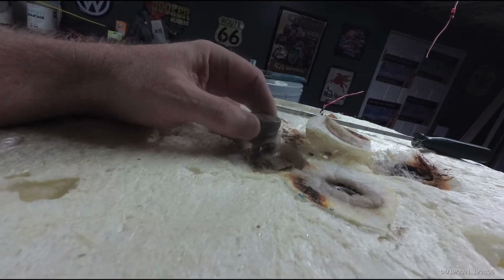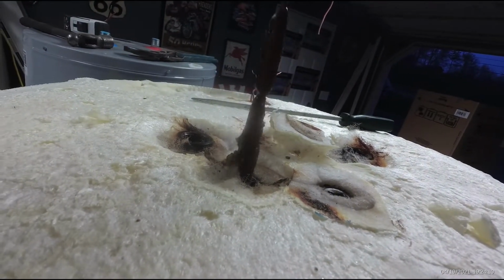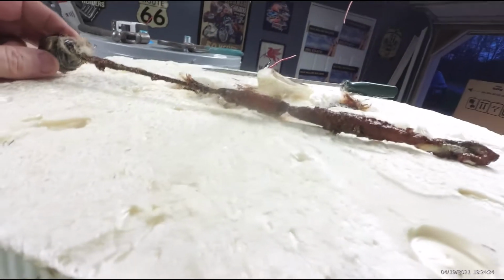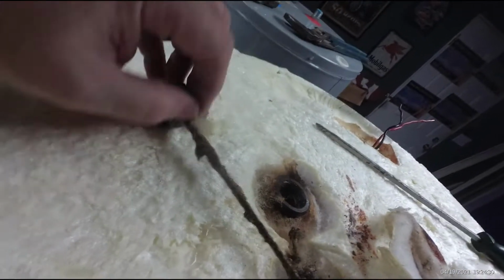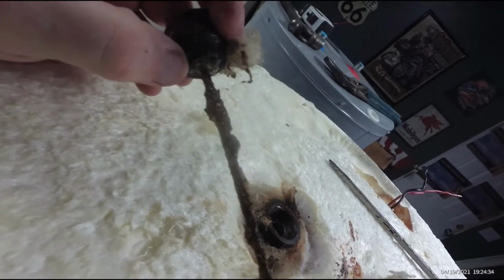Here is an 8-year-old anode rod. Now, this is only about a foot long, and it's only about the size of a pencil lead. There's a little bit of corrosion on it. This thing should go all the way to the bottom of the tank, and it should be, I don't know, maybe 3/4 of an inch thick. It should be about as thick as this plug. If you look at the plug carefully, you can see where the shoulders were.